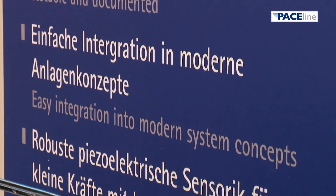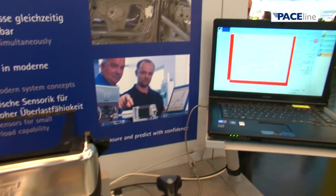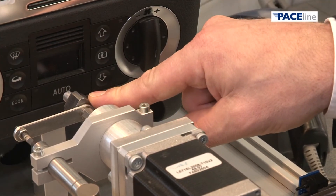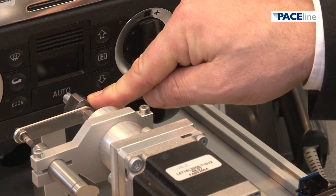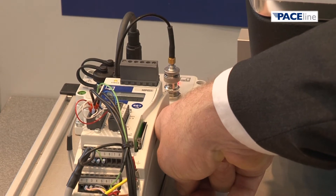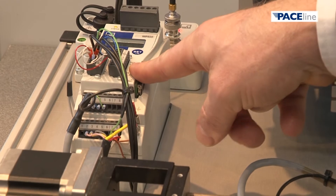What are the production cycles involved here? Here you can see the reproduction of a test cycle of a running production. Tested are controls such as window lifts, switches, or even parts of the cockpit interior from a running production. We see here in front the sensor for detecting the probing force. Piezo-electric sensors are used here.